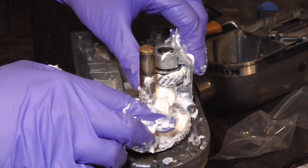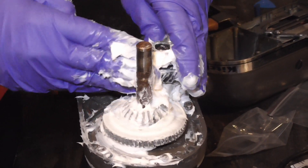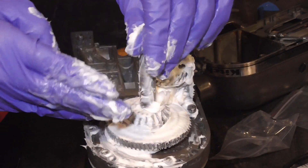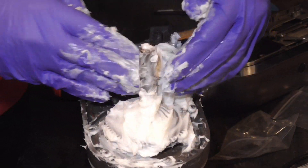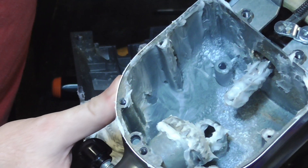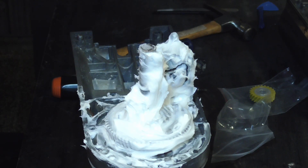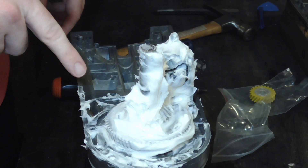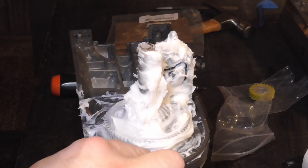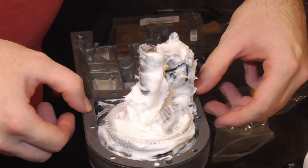You've got a big old tube full of grease if you've got the Mobil grease, and there's no shame in wearing gloves. You can manually turn it and put a ton of grease right up in here — you're almost aiming to make a mess. Now wipe down the mating surface here so there's not an excess amount of grease on there. It's okay if there's some grease on this surface — we're just trying to take the excess off. A little bit there shouldn't be a big deal.